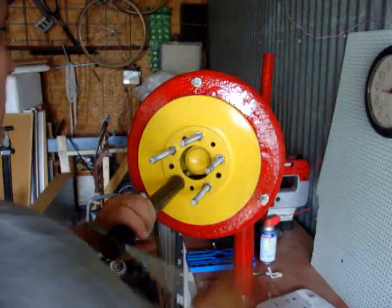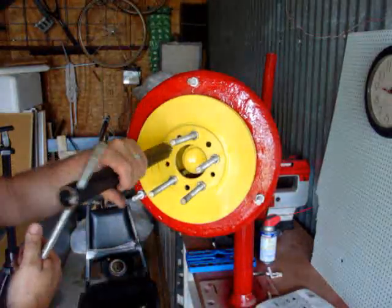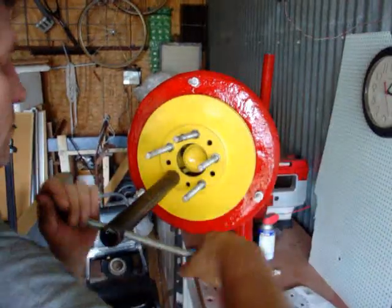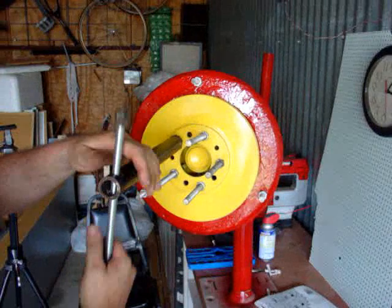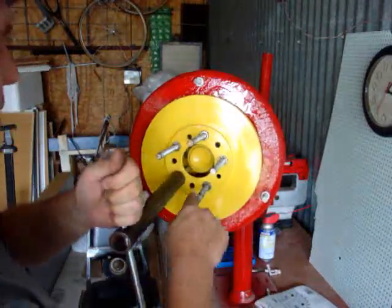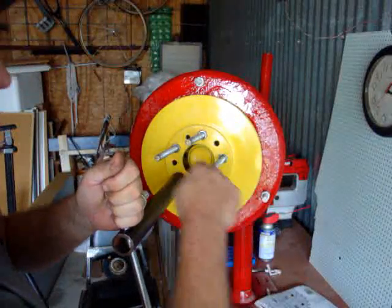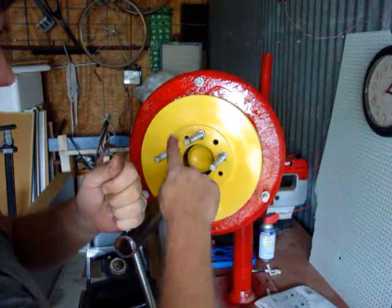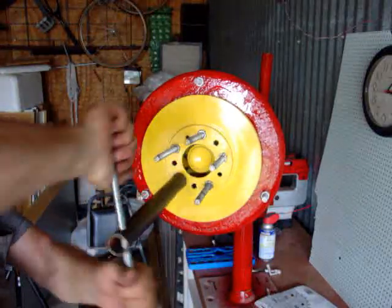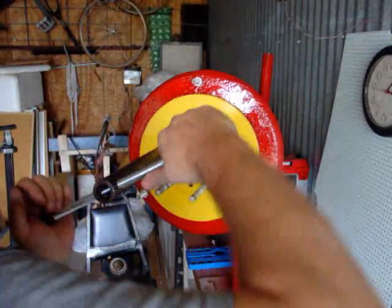I can use this short one — gives me something to work against. We go from this one to this one to this one, skipping around in any direction. Don't do the one next to it — you can warp your rotor that way, and that goes for your car too.